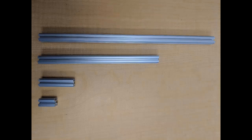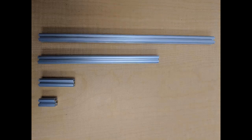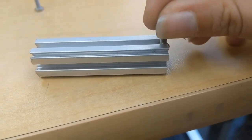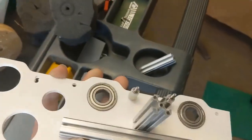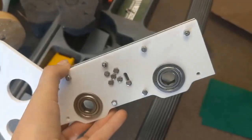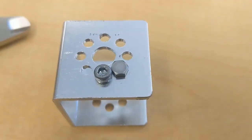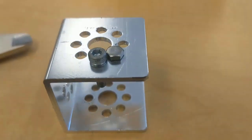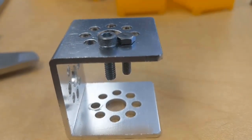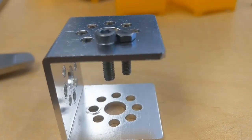After being bought, extrusions can be cut to a desired length. Each REV bar has channels on each side that you slide screws into. They also have tapped holes on each end that you can put screws into. REV uses M3 hardware with hex head screws. M3 is slightly smaller than 6-32, which is what Tetrix uses. You can use M3 hardware on Tetrix parts, but you can't use Tetrix hardware on M3 parts.